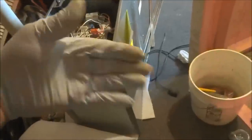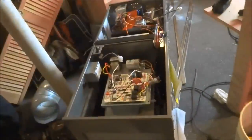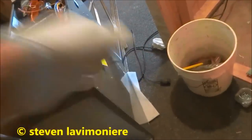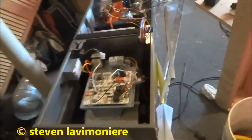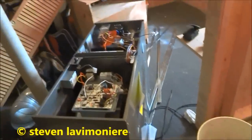I got the furnace here on its back. I gotta cut the side out and then climb down inside there to tie in and roll the ductwork in. I disconnect all the wires, tie-wrapped out of the way for now. I'll pull the fan out, lay this on the side, cut it the same as the other furnace, and put the return grill on the side so I can slide my filter in later. I'll worry about tying the top in after. It's a tough spot to work in.